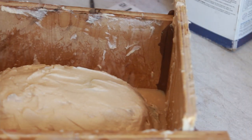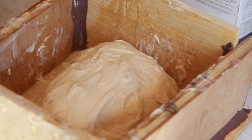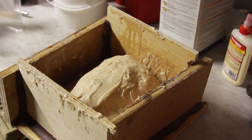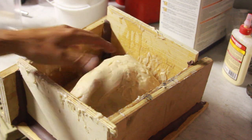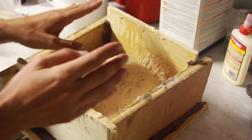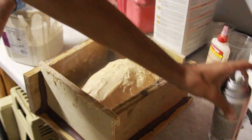This is pretty much a very smooth mold now. The next step is to let it dry out and see any imperfections, try to smooth them. I'm going to wait maybe a day — this is going to harden up. And then I am going to add plaster of Paris and then remove it all and do our first casting. We've waited quite a few hours and you can see this is hard to the touch. This is essentially a shell, but it's a flexible shell. In order to do our casting, it's a good idea to make what's called a mother mold — a much stiffer mold that will basically hold the shape of this. If I fill this box with plaster up to here, it'll be very easy to make castings.